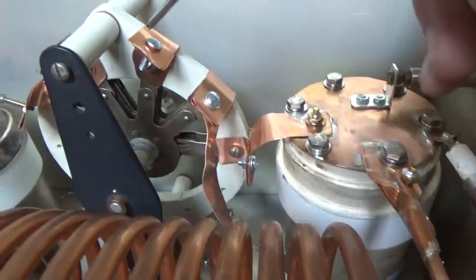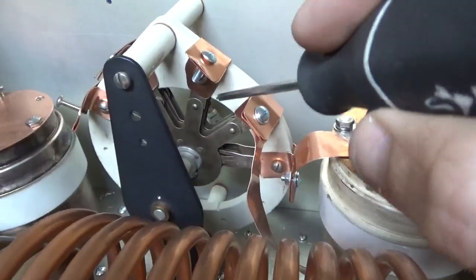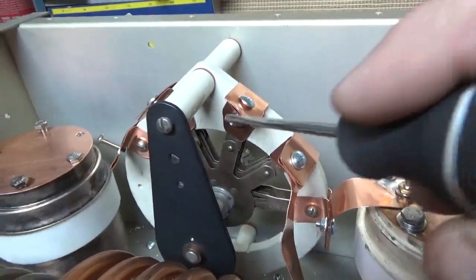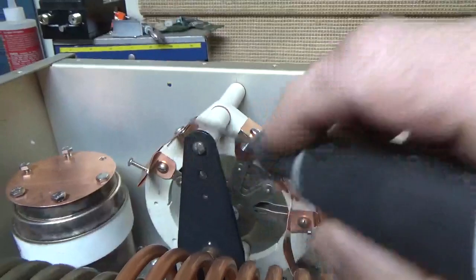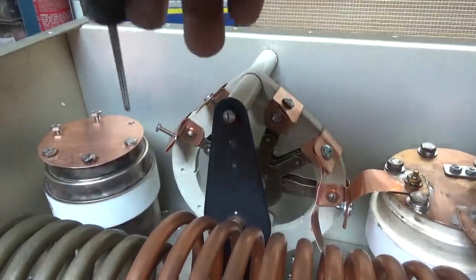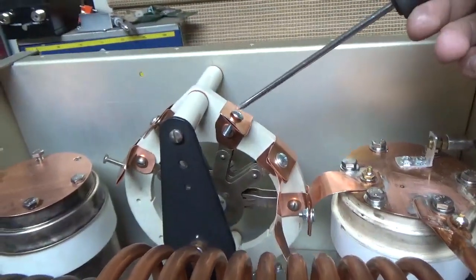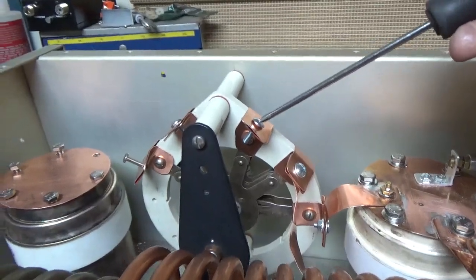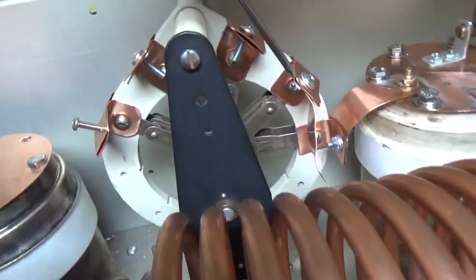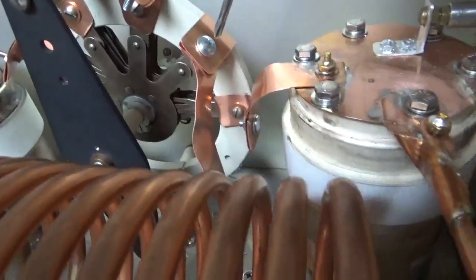I paralleled the contacts — used a silver-plated brass screw that goes through, with a copper washer on both sides. These contacts are for the other bands: 40, 20, and 15. These screws will be cut down — they're just temporary to keep them together so the holes are lined up. You can see I cut these ones down so the RF isn't going through — they're just squishing everything together.